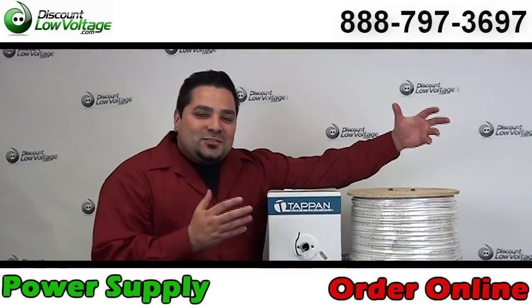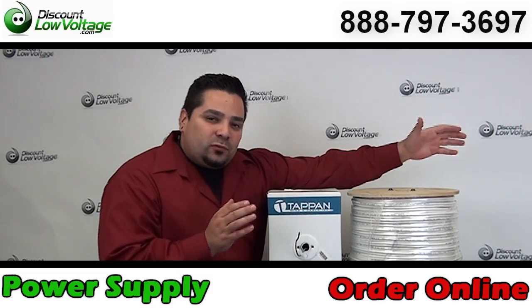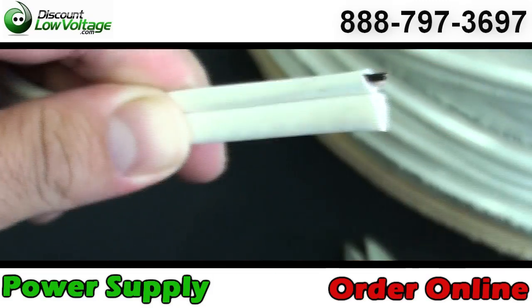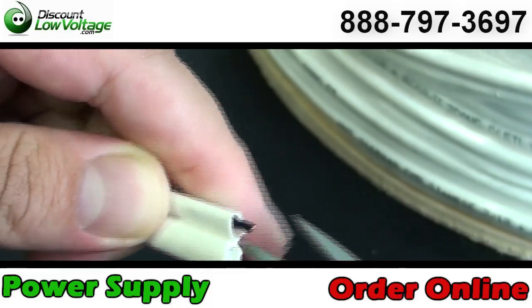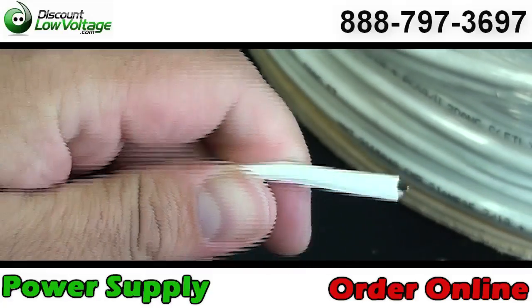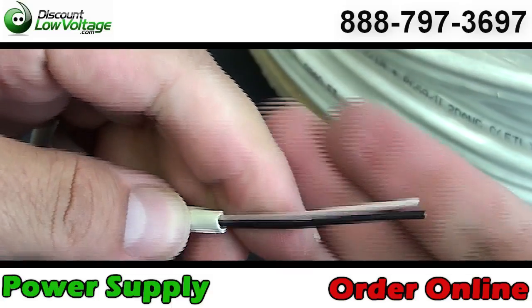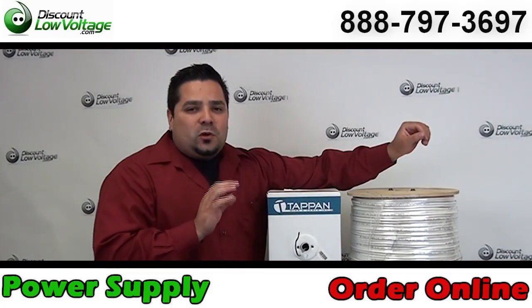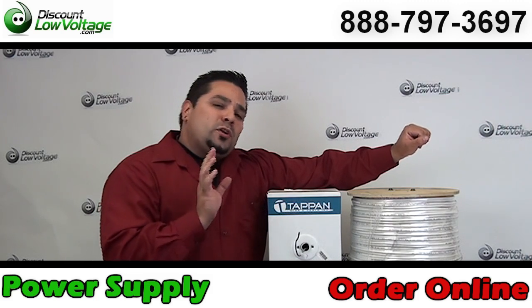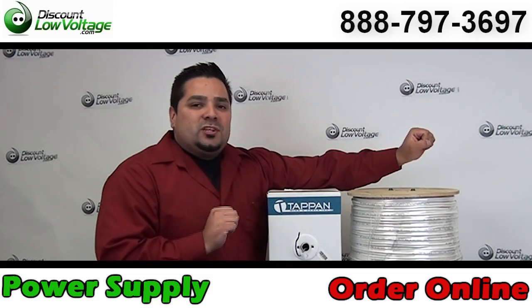Okay, guys, so we're going to talk about the power cable for security cameras. Now, there's a couple of different ways to go about it. We have the Siamese cable, which is the RG59 with the 18-2 attached to it. This is very popular, and you're going to want to use this when you have the option of having your power supply next to your DVR. Sometimes with certain DVRs that are rack mountable, you're going to want to lock them down in a telecommunication closet on a rack, or somewhere else that's hidden so nobody can mess with the footage that's recorded.